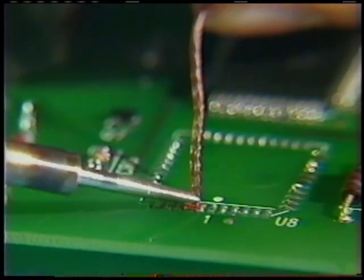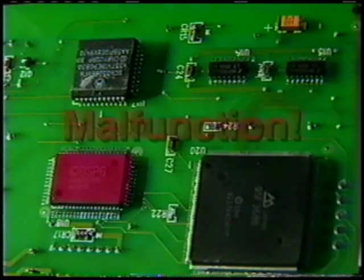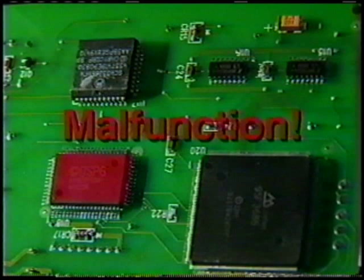After you decide you have an issue with a circuit board — it typically resulted from a bad chip — you must find it and remove it. You must also remove the solder wick residue from the pads. Solder becomes embrittled if you reheat it too many times, which can lead to a failed solder connection and a major breakdown in your system if you do not remove the solder.